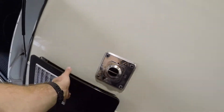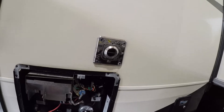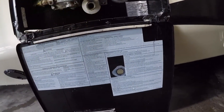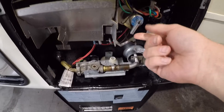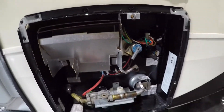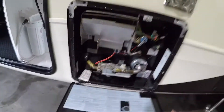Now we'll go to the outside of the hot water tank. This unit is winterized, so the drain plug is out — normally you'd have it in. Before you remove the plug, the important piece is this pressure relief valve: open that up first, then take out the drain plug. Otherwise that drain plug will shoot out of there like a shot.